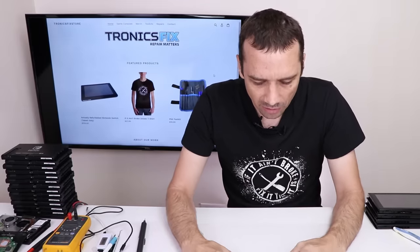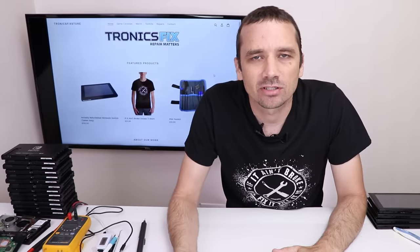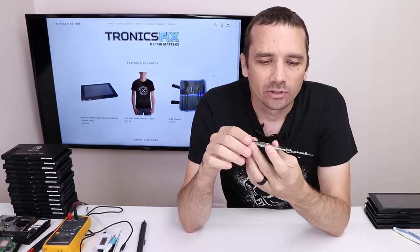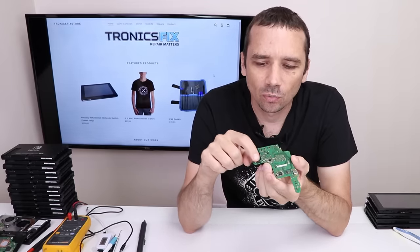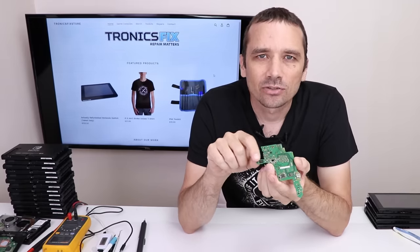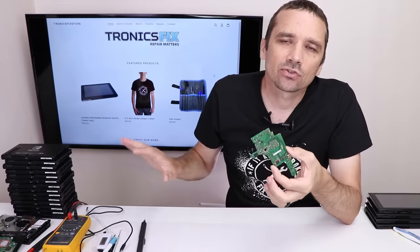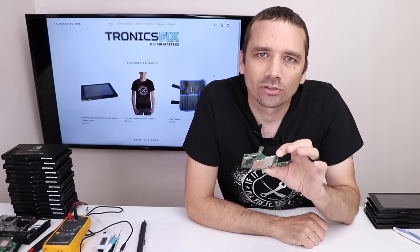So what I'm actually going to do is wait until I get one that's one of these other ones where the motherboard is damaged or not fixable. And then I'll plug this motherboard into that and see if it works. I did take this motherboard and look under the microscope and found that this chip also had a little bit more corrosion under it. So I took a toothbrush and worked on it from each side and tried to get the bristles down inside into the solder balls to clean them off. And I think I did pretty well, but I won't know for sure until we can test it in another case. So for number five, we're gonna set it aside and wait till we have another switch where the motherboard is not fixable. And then we'll just plug this one in and see if this one works correctly.